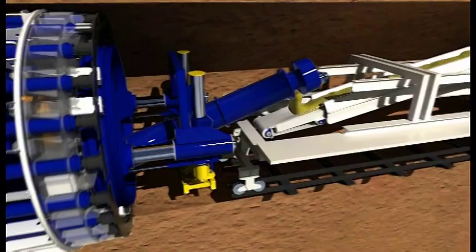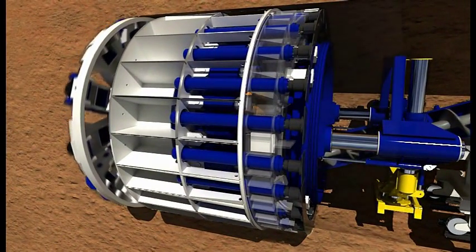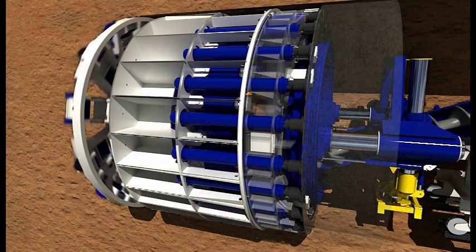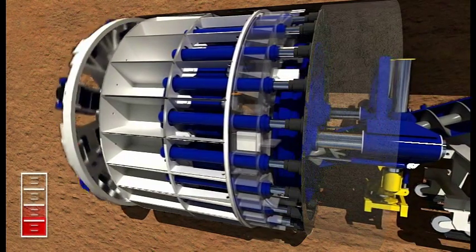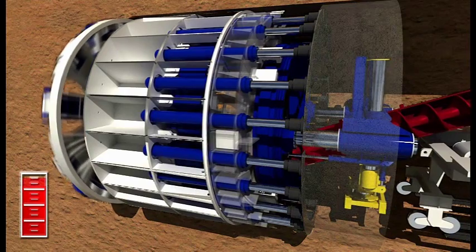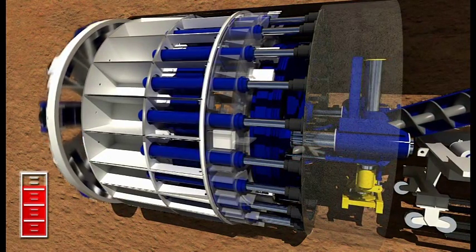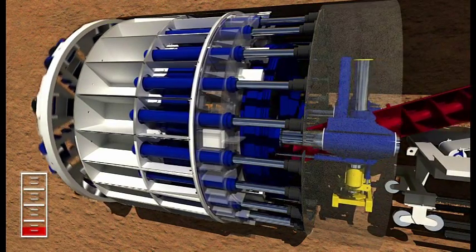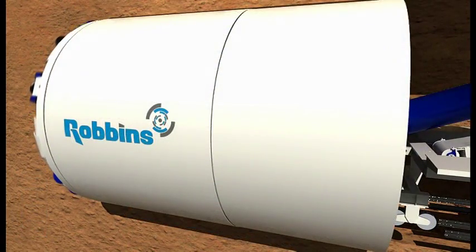The ability to balance the earth pressure is essential in order to safely and efficiently excavate the tunnel face. A TBM operator can control the pressure in the chamber continuously. To raise pressure, the operator can either increase the machine's rate of advance or decrease the rotation of the screw conveyor. To lower pressure, the operator does the opposite, either decreasing the rate of advance or increasing the rotation of the screw conveyor. The EPB cutter head is followed by a shield body.